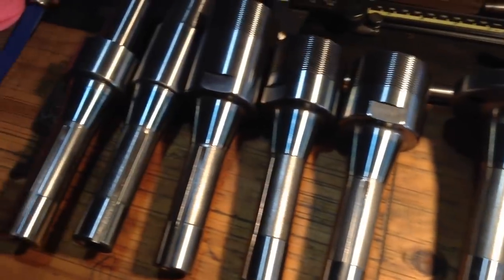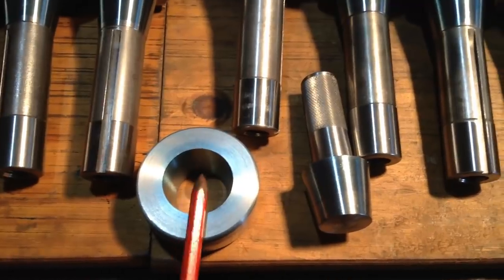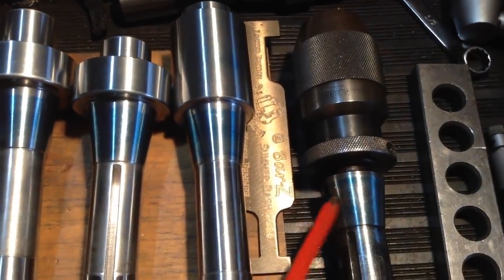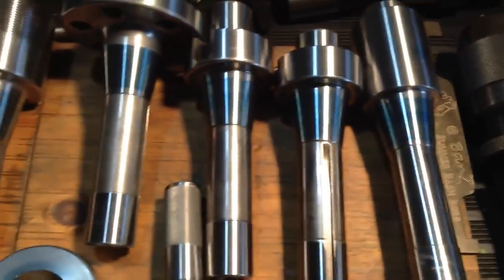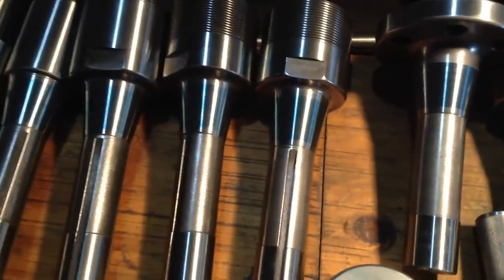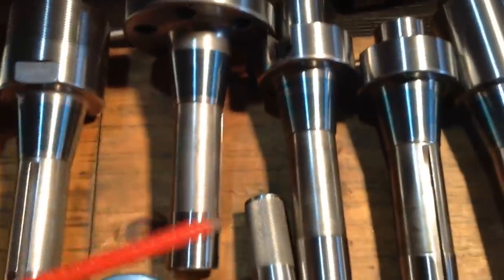Okay, so we've had a good grind on all our tapers. They've all blued up very well. Remember some time ago we made these taper gauges. So we've just re-verified that on the Albrecht German chuck, and also the quill, the spindle in the Bridgeport. Yeah, they've come up well. Nice finish and blued up spot on.